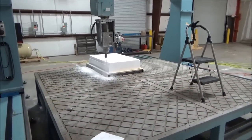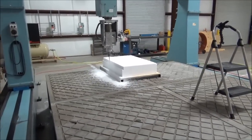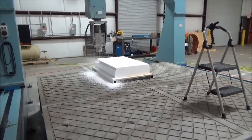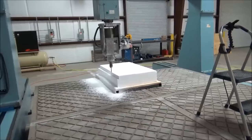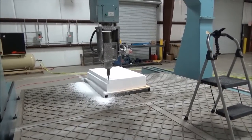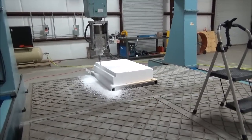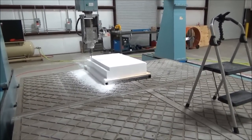We'll just slide up the mill for the first piece. It's doing a rough-in right now, and then it'll run the program for the finish surface on the front. This piece is going to be the left and right upper door outer skins just above the windows. This program takes about 15 minutes to run, and then the other ones take about 10 minutes each.